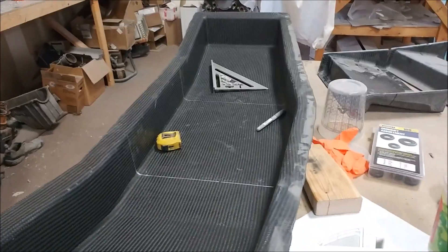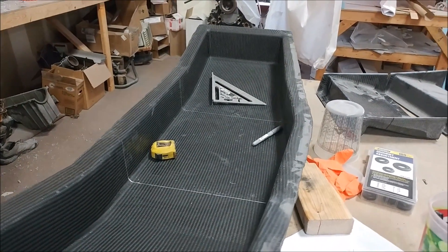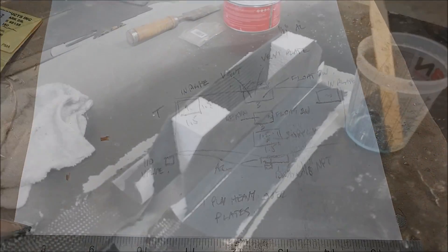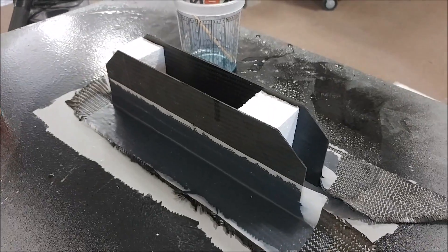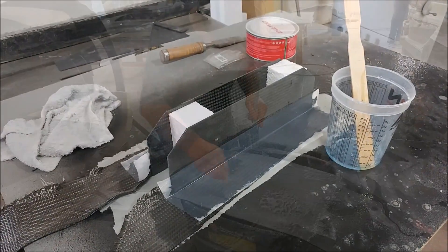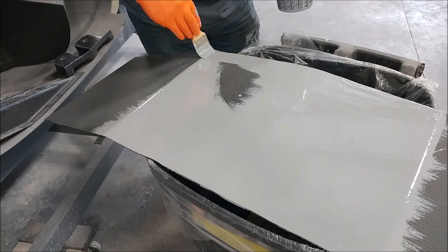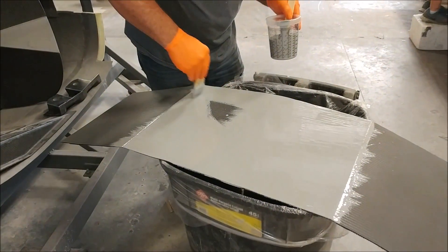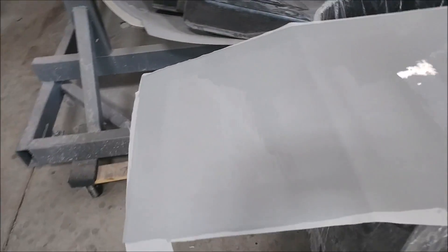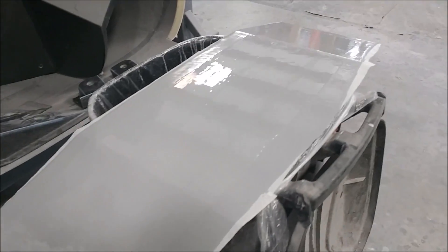Here's our tank — this is basically the inside of the header tank. It's shaped to match the shape of the aft bulkhead and is tapered so it has a low point. Jeff has laid up some flat stock and put right angles on it for bonding flanges for the baffles that go in the tank — just two of them to separate things. Here's the back wall of the tank, and he's painting it with Jeffco — that's the product you use for these composite aircraft to seal off the tank so the diesel doesn't permeate through it.